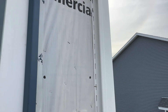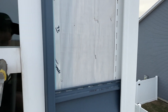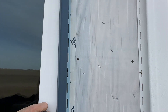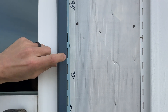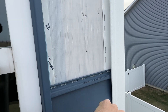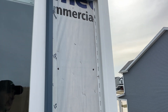I want to see how often they are nailing that, and I see one nail head there. Best practice is about every 16 inches, so I think they were not doing that. And the J channel alongside the window is missing all sorts of nails and is out of place. So I need to re-secure that, and then once I get a solid corner piece — I'll put a few nails in — and get my J channel secured, I can go ahead and put those pieces that pulled off back into place.